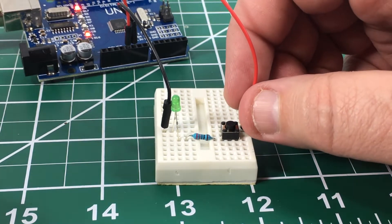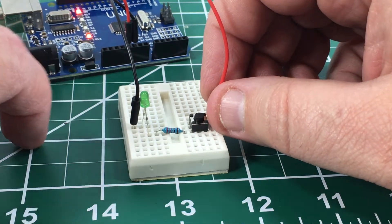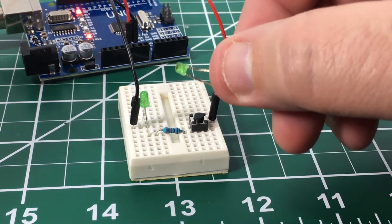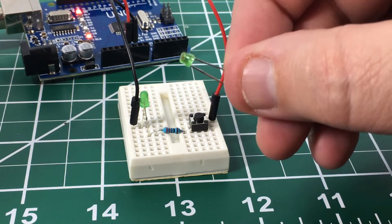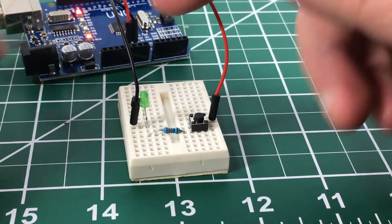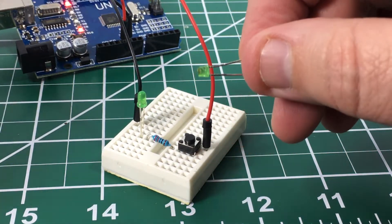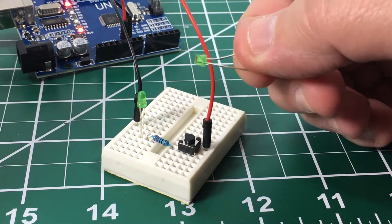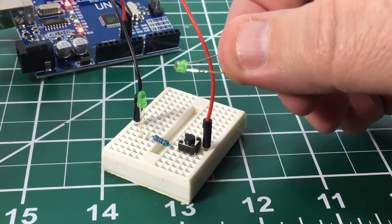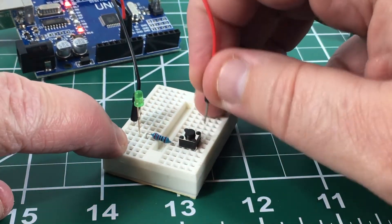I want to warn you — earlier I was playing around with this and decided to see exactly what would happen if I connected 5 volts directly to the LED without going through the resistor. This is not coming from an output, just coming from the 5 volt power supply here. The top physically blew off the LED — it cracked, flew at me, gave a burst of flame and smoke, and exploded. So yes, they will actually explode.